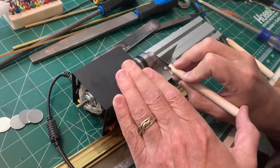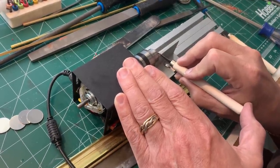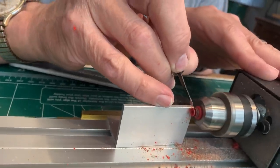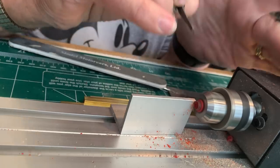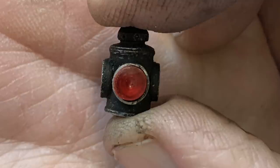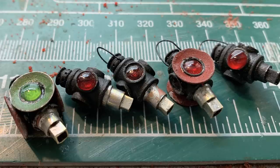Now the trickiest part is cutting the back side of the lens to duplicate those Fresnel rings. I come in with a very small, very sharp tool and do stair-step cuts until it cuts free, usually getting one or two rings cut into the back side. You don't ever see the back side, and when you view this from the front — it's so darn small — it does tend to look like a Fresnel lens. I find it acceptable. Each one I make turns out a little better than the one before.